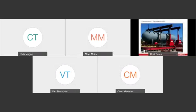Okay, so let's start and look at the components of a typical gantry assembly. We'll start at the very top, looking at our header beams. These are typically wide flange members. You can also use built-up box shape members, but these are what actually take the load you're lifting from your rigging out to the main gantry legs.